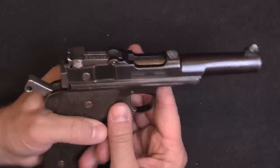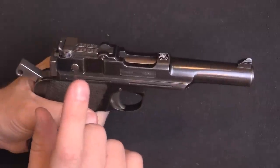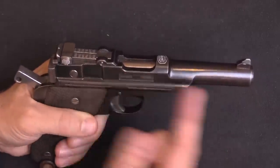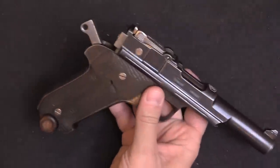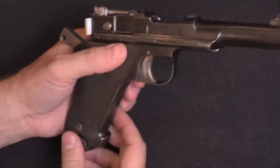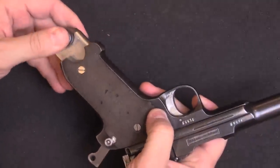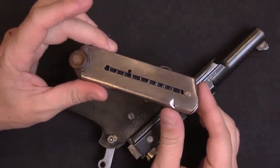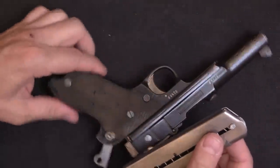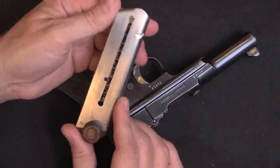Because this gun's in beautiful condition and I don't want to damage it in any way, ironically perhaps. Simple blowback, but chambered for the 7.63 Mauser cartridge — which means, I guarantee you, some of these got used with 7.62 Tokarev ammunition. Which is a little bit terrifying in a simple blowback pistol. I would not want to be the one firing that off myself.